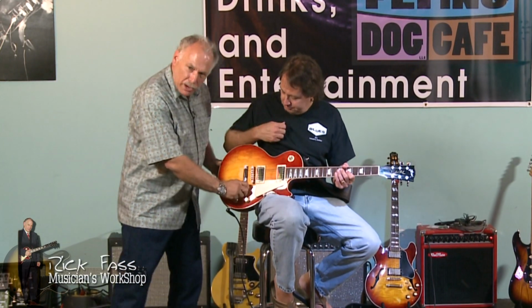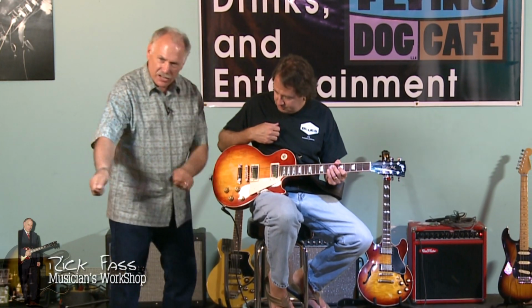On a side note, typically when the guitars come in out of the box, as you roll down the volume, it starts to do this. Right. What happens is that as you decrease the volume, you increase the resistance. By increasing the resistance, you lose highs. That's what happens. So as you roll it down, it's like, God, it sounds so great when it's wide open. As I roll it down, I got to change the amp or whatever. So anyway, it's a very easy fix. A capacitor and a resistor, and you're done. It goes right in there, boom, done.